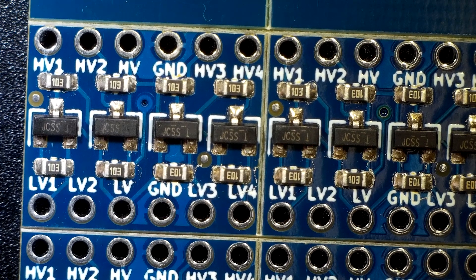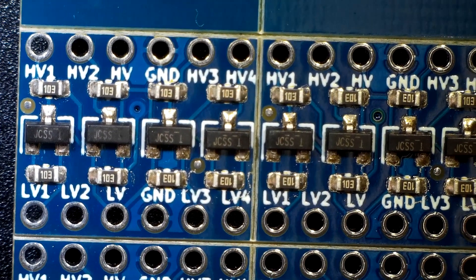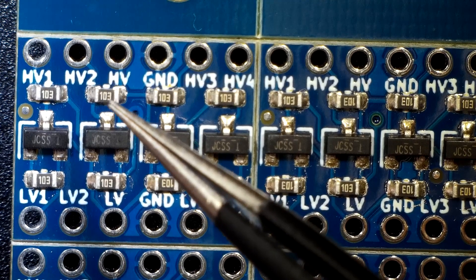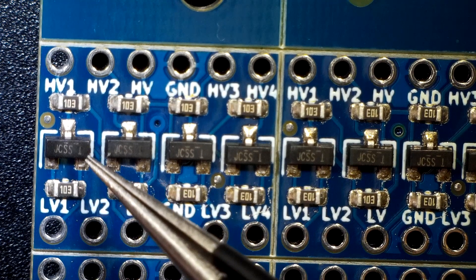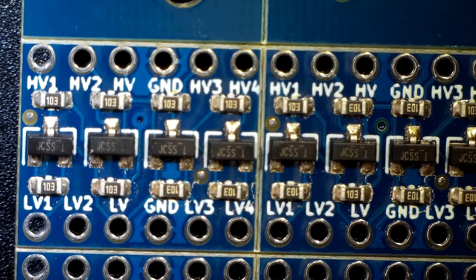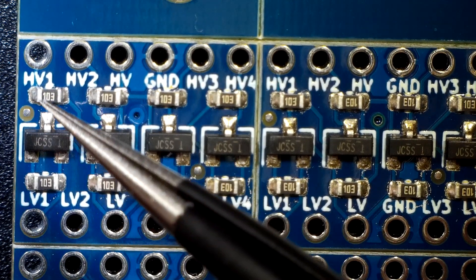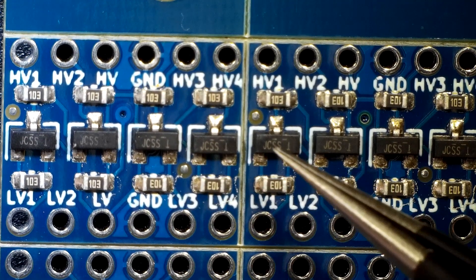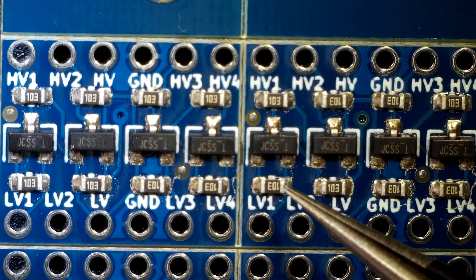Counting out the way the machine is currently placing parts: we have four nozzles configured for the transistors and four nozzles configured for the resistors. So in the first gantry movement we get one, two, three, four transistors and one, two, three, four resistors. Then there's a second gantry movement for one, two, three, four more resistors. If we place the whole panel as if it were a single PCB, we could configure the nozzles for three transistors and five resistors to make eight nozzles. That means in the first gantry movement we would get one, two, three transistors and one, two, three, four, five resistors.